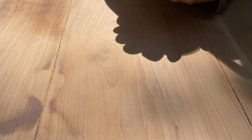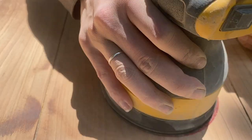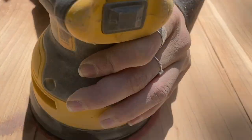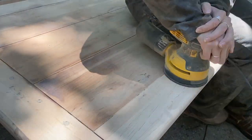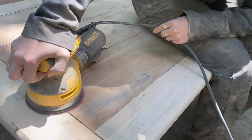Here's a good example of why we finish off with a 220 grit. As you can see, it left little squigglies behind, and moving on from a 60 grit to a 120 and then to a 220 just helps get all of those squiggly marks out and make sure that your finish is really nice and smooth. The 220 knocks everything down that was left by the 120, and the same thing goes for the 120 taking care of what the 60 grit left.